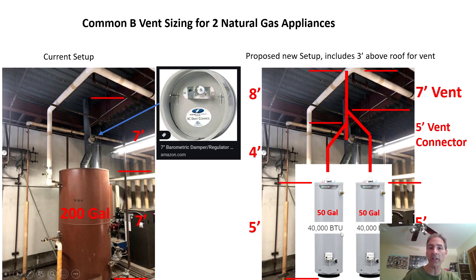I believe we will be perfectly fine with 100 gallons of capacity. I'm proposing to design a system that has two 50-gallon water heaters, both natural draft, with the water piped in series so that hot water comes out of one and enters the cold water inlet of the second, giving 100 gallons of capacity with two separate appliances. That is why the venting system has to be designed and installed for two appliances.